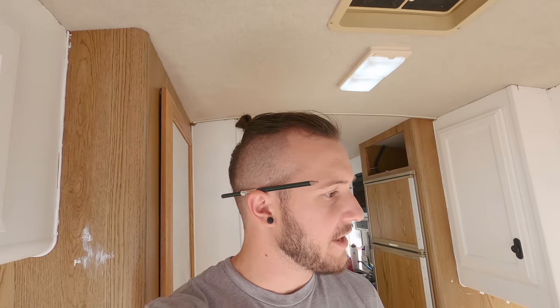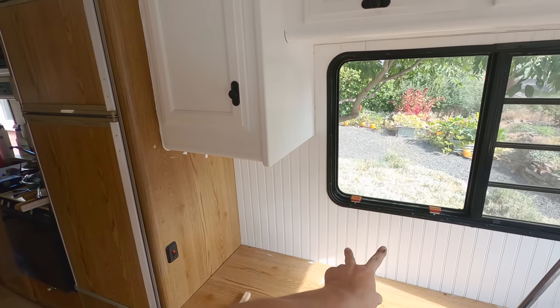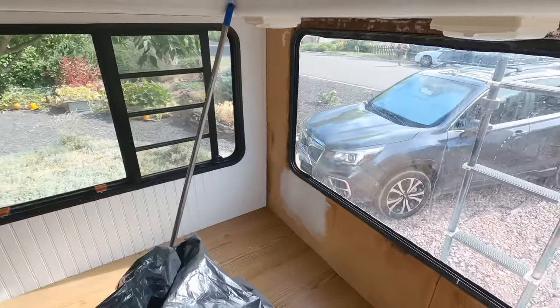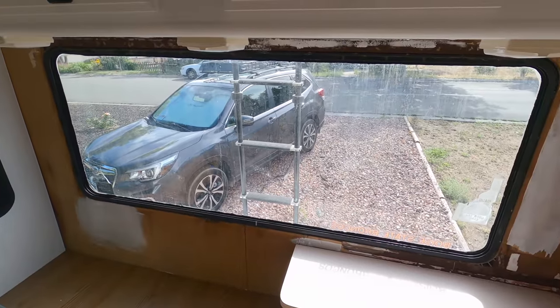I'm about to start on the next panel, so I figured I'd show you how to do it in case you guys are interested — whoever has RVs and wants to do a remodel. I had never seen bead board used in an RV before; I tried searching online and couldn't find it anywhere, so I was like, let's just try it, let's be the guinea pigs. You can get huge sheets of bead board at Lowe's, cut them up, and butt them up against each other. This is actually two pieces — there's a line here but it's camouflaged by the beads.